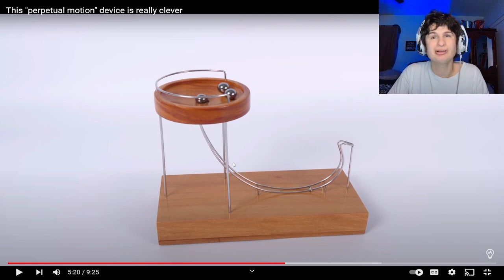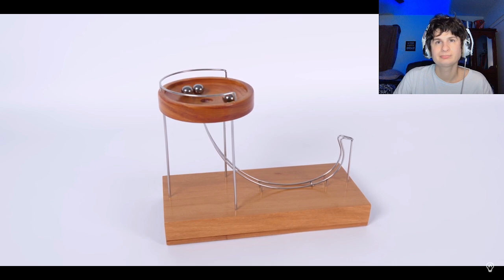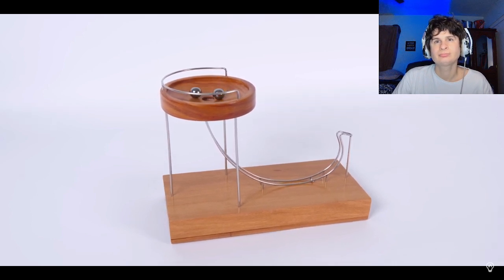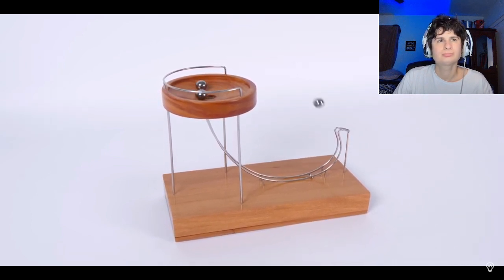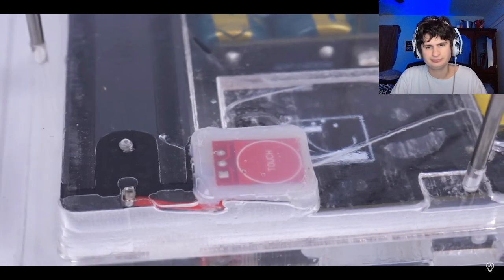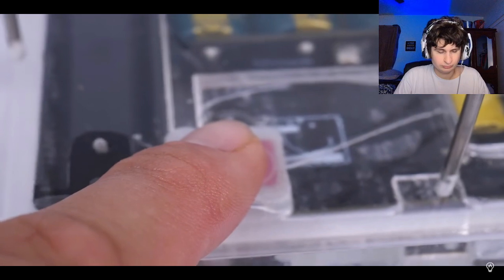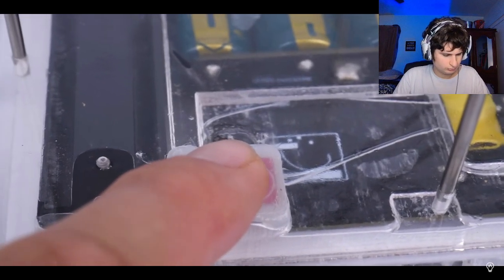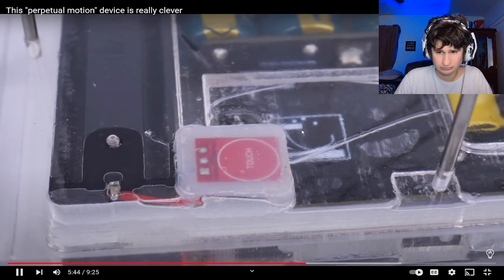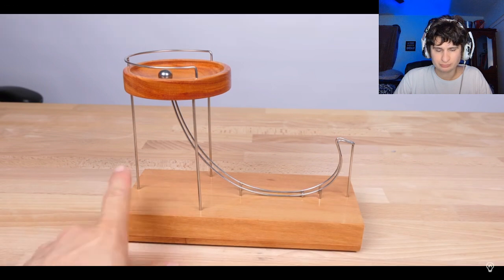William does the fine tuning before he sends it. The final thing is the power button. You really don't want your perpetual motion machine to have a power button — it kind of spoils the illusion a little bit. So here, under the acrylic, you can see a capacitive sensor. When you touch it, you're adding the capacitance of your body to that little bit of acrylic. That sensor can detect the change in capacitance and the circuitry interprets that as a button press. So in the wooden version, it's as if there is no power button.